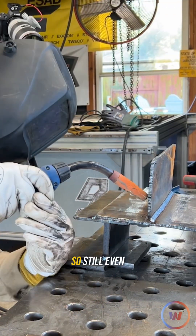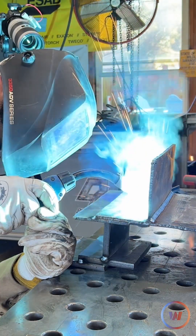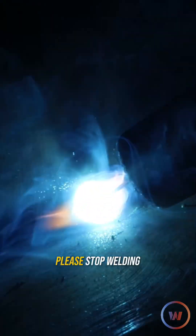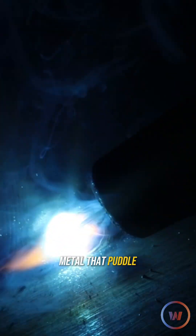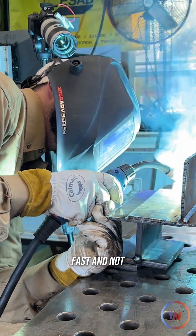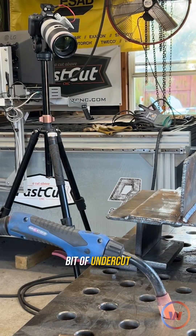This ought to make a mess. So still, even less wire, even more voltage. Trying to maintain a good proper travel speed, but if you're hearing that sound, please stop welding — stop what you're doing. You can even see that little bit of undercut at the front edge of my arc. It's just that arc is cutting into the plate, and the filler metal — that puddle — isn't there to fill it in. Just moving too fast and not having enough wire feed is going to give me quite a bit of undercut.